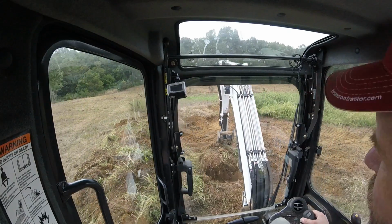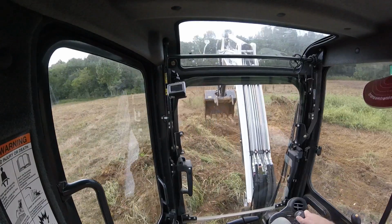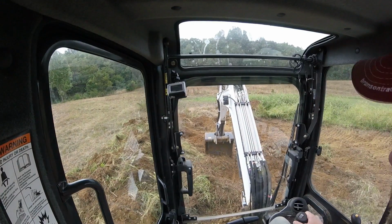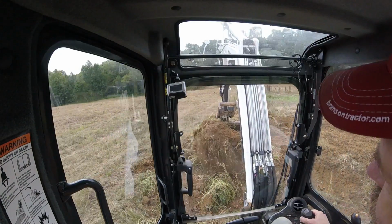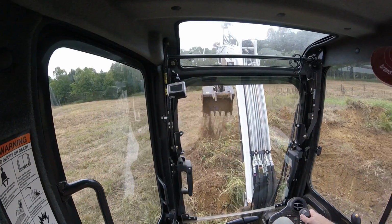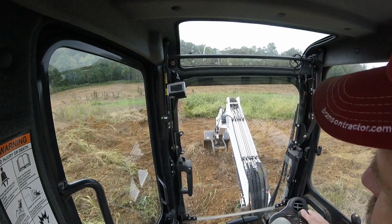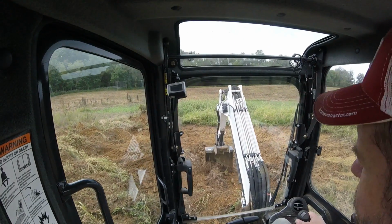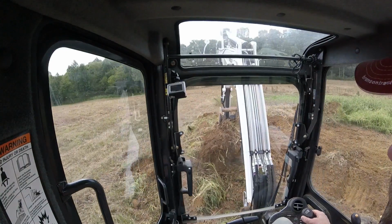Or sometimes they'll hold less water than what you think, but now I've come a long way, I suppose, and now I really try to make them pure clay, try to dig a core trench beneath the dam and try to compact the dam all the way up. I don't always compact the bottom of it. That just kind of depends on how moist it is.